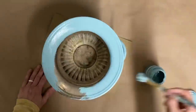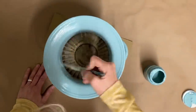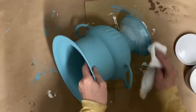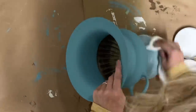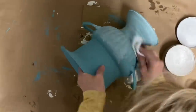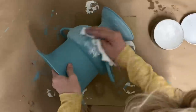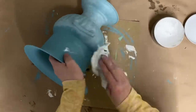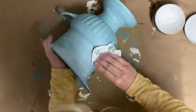Once I let that dry, I take it outside and spray it with a clear coat. I use Rustoleum matte finish clear coat, but you could use any clear coat you want. Then once that dries, I'm going over it with some white wax — I get my white wax from Dixie Belle just because I sell their products in my store. You could brush this on with a wax brush and then wipe it off with a cloth, but since I haven't let this paint dry very long, I'm just going to wipe it on so I don't put too much pressure on it with the brush. You could use a clear wax or clear coat if you didn't want this milky white look — I just like how that white wax settles into the details.